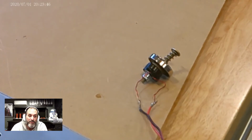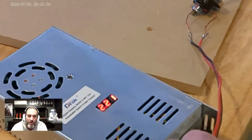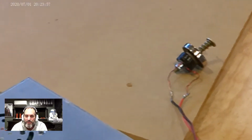So yeah, they do get better. Like I said, you got to start somewhere. It has no pulse when you run straight DC, so you got to turn it on and off. So most of us just use a transistor or MOSFET when you get there.